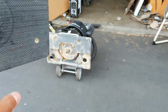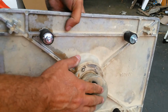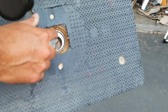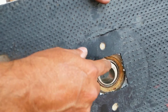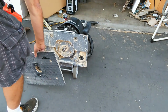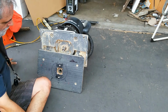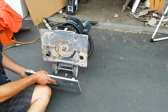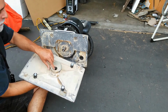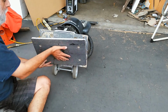And if you take this driver pad off and this part is left on the machine, what'll happen is when you stand this machine up, it'll push this pin into that piece right there, and you'll never get it out. So I've done a few of these things. I just take the preventative action. I put that hardware back in there, but it didn't come off the normal way. Like I said, the eccentric came off with the works there. So basically I've got to register this pin here with that shaft there. So I'm going to go ahead and do that right now and get it back on.